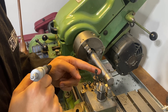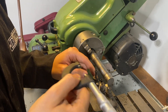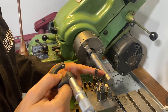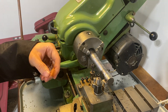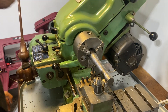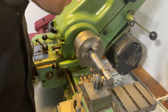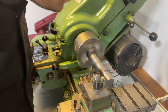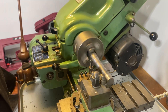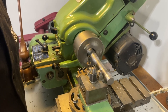What I'm also going to show is taking cuts on this inner piece right here. You obviously want to take multiple passes so it is really thin, so that when you go and do your aligning you can take multiple passes just like I did without having to re-cut the inner side. I'm going to dial it in. There we go — pretty good chips right there breaking off.